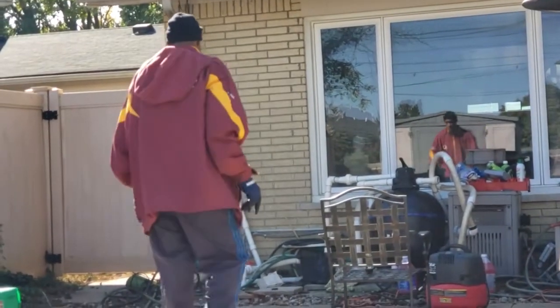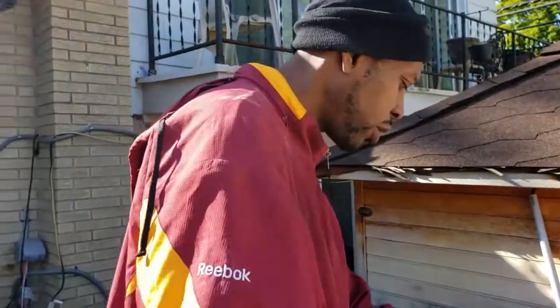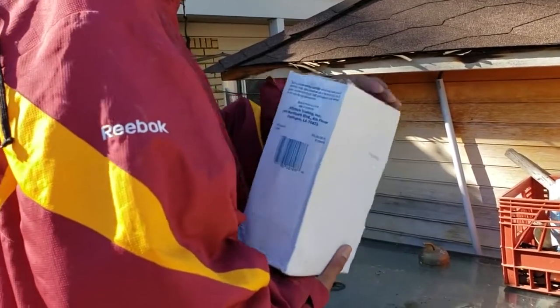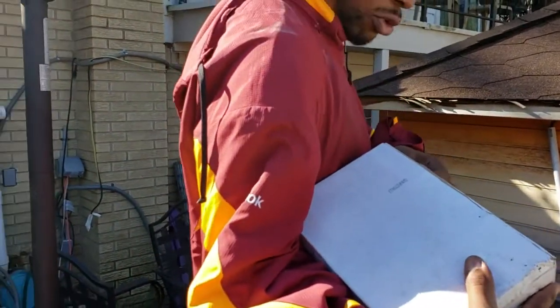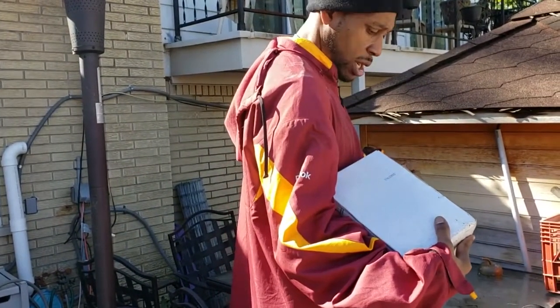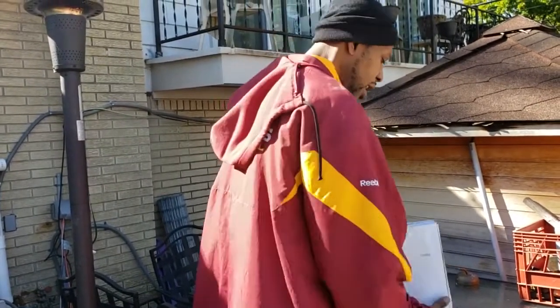So as I'm doing all of this prepping for getting the pool closed down, getting antifreeze in the line, I got my pool cleaner still going in the pool, making sure that it's getting anything that may have settled in the water. And I like to use the little generic pool closing kit to winterize the pool with the chemicals in, because I'm going to leave about three inches of water just underneath my pipe in the pool, and that's going to help to keep the pool liner down over the winter time.